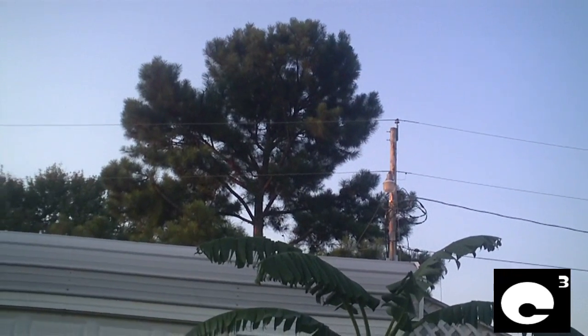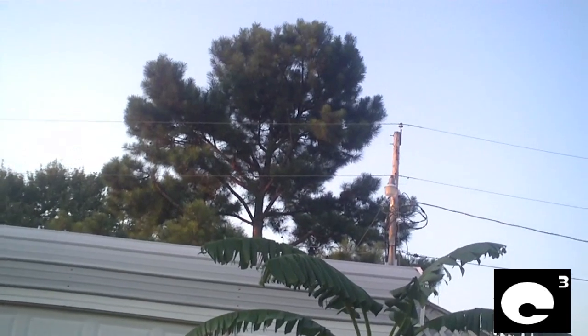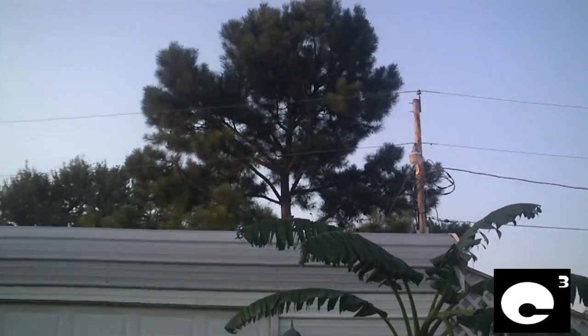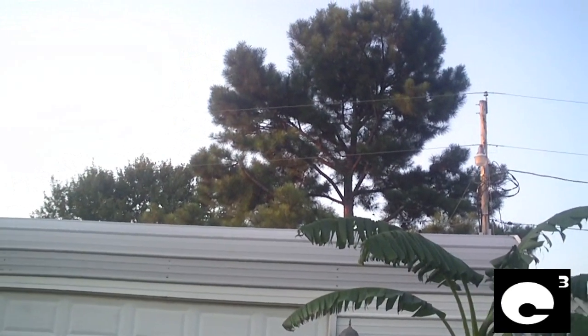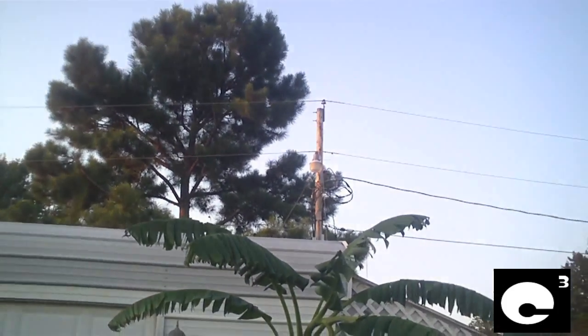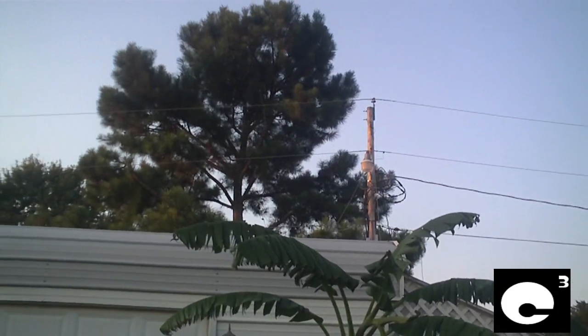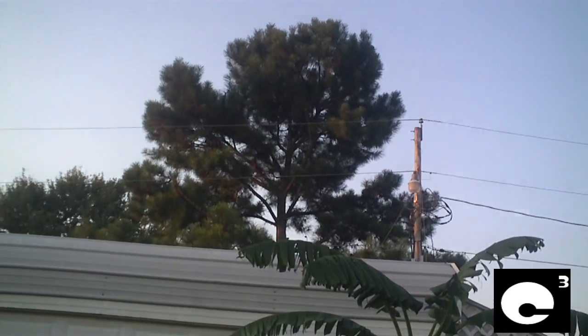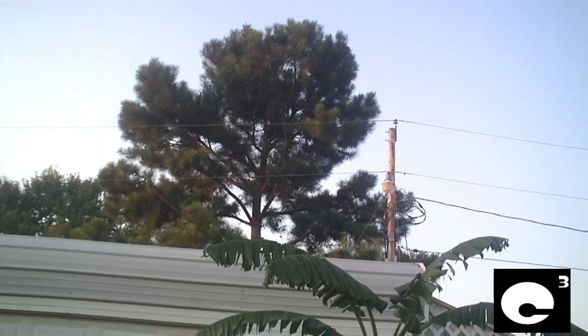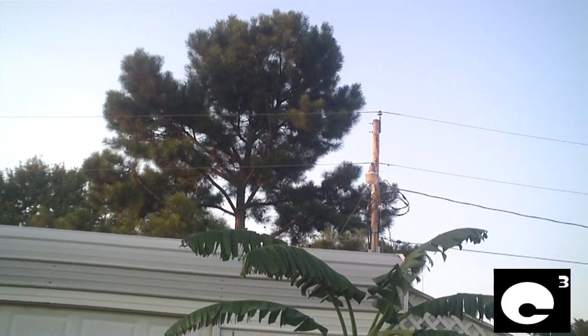So let's say you know your electricity is fed from a power line on a fuse cutout for any reason, and you tend to lose electric service pretty often — you have dips, blinks, or complete losses of power really often. It's important to make sure that the tree limbs are not touching lines and make sure there's no kudzu or anything growing up with the power lines.